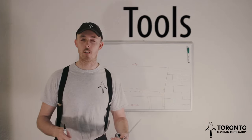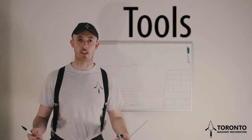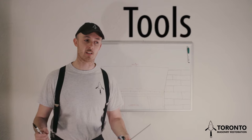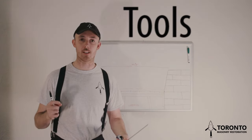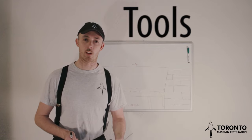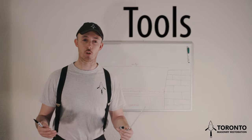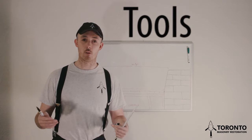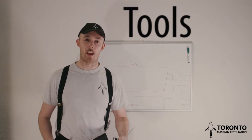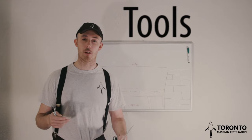So what I use is a T bevel, a pencil of course, a brick hammer, a trowel, a slicker, a variety of slickers. I'll typically use a 3/8 slicker, and a slicker that's slightly thinner than that, just so if there's any tight joints I can get my slicker in there. I'll use a tape measure, of course, a hand brush, a 4-foot level, a bucket of water beside me, and I'll have a blower, and a grinder with a diamond blade on a flush mount.